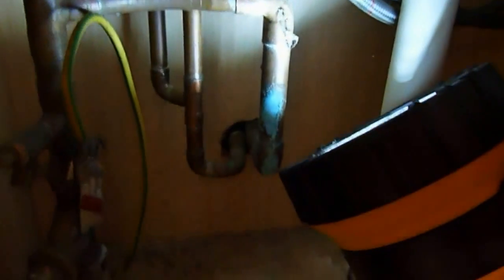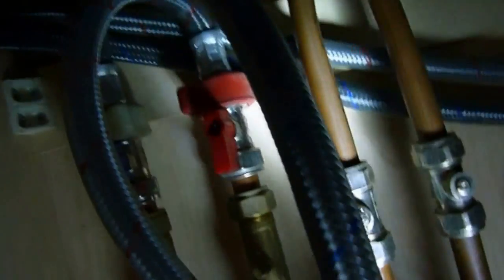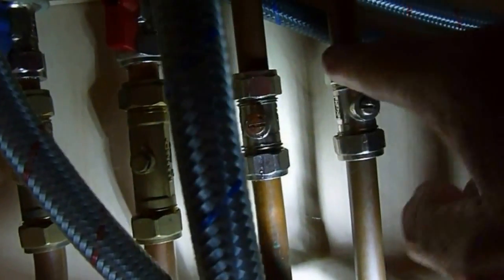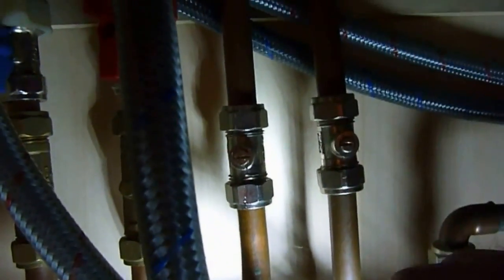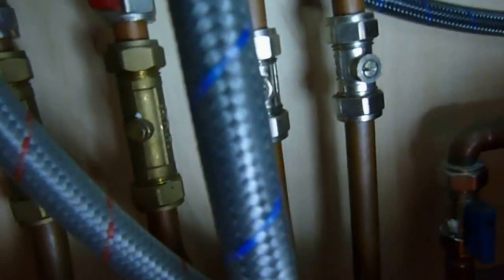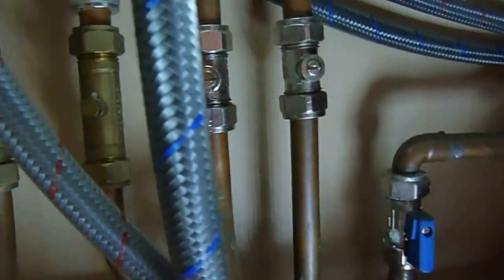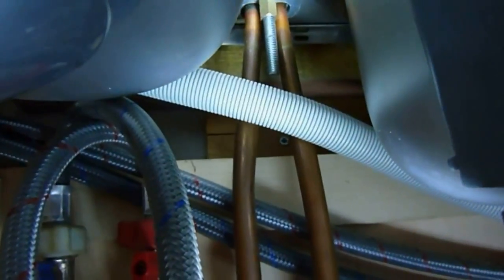So we lift that out of there and get a bit of access to the job. Now if you look up there with the torch, you'll see there is a long bolt with a brass nut on it, and that's got to be undone to get these taps loose. We've also got to undo these two joints here, knock the olives off, and then we'll be able to pull these taps out. We're going to try to loosen that nut up there first. There is a spanner you can use for that - sometimes they have a screw-type thread on the end of the nut which you can undo with a screwdriver if you're lucky.